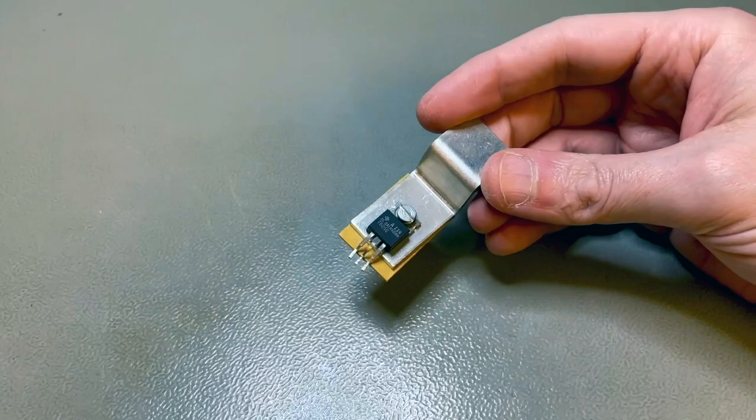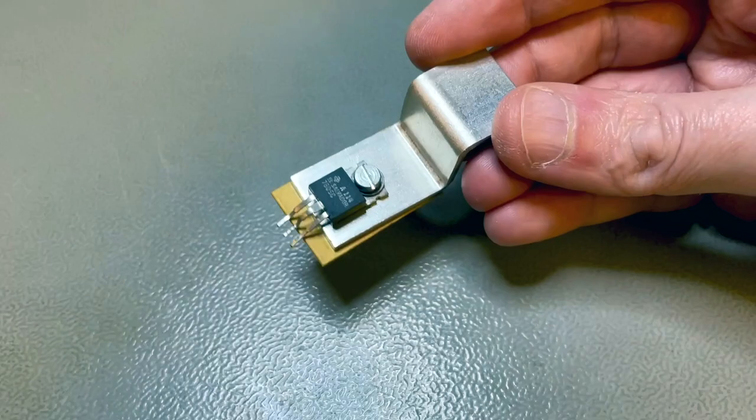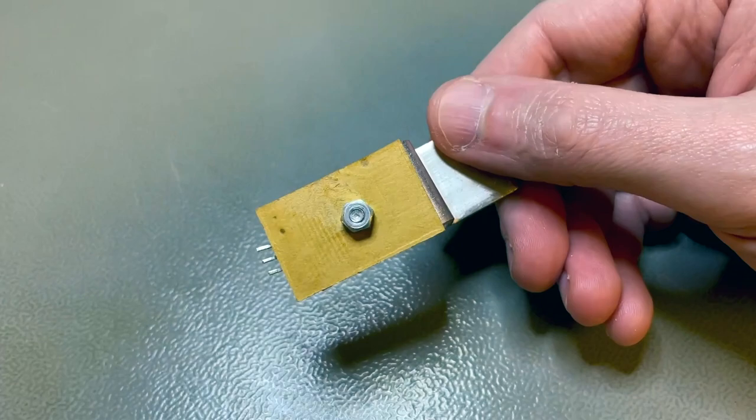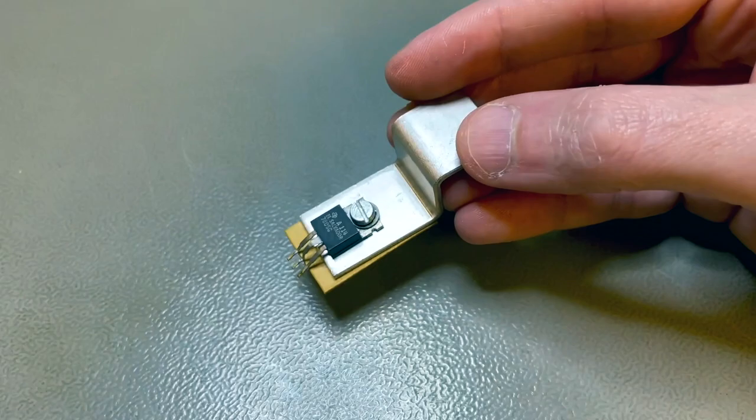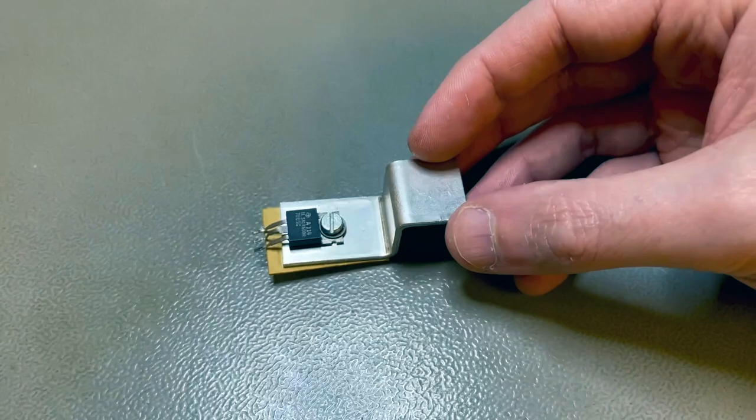The original has a linear voltage regulator with a big heatsink because it produces a lot of heat. The problem is the ZX80's case has no ventilation and it's tiny, so the heat produced inside tends to be one main factor for destroying components. So I think it's worthwhile, even in a restoration, to remove the linear regulator and replace it with a modern switch mode DC to DC converter that produces basically no heat.